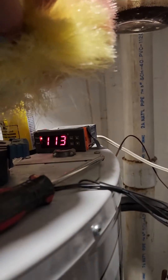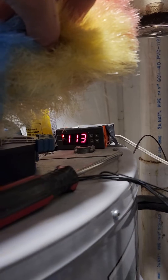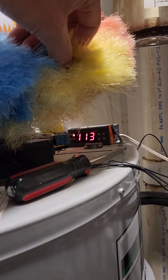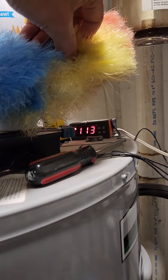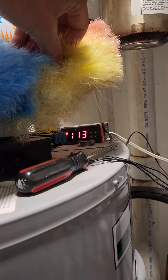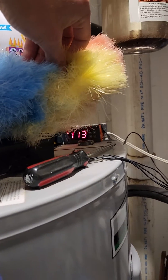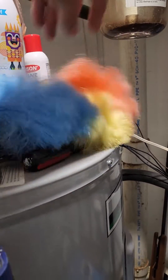I have my little Chinese controller set up there. I had the kitchen running hot water and the washer was running water, so it dropped a bit. I did set it to 119°F to turn on and 120°F to shut off, so it cycles lots of times a day, but it makes sure there's plenty of hot water anytime you want.